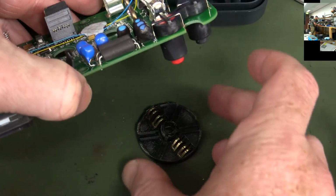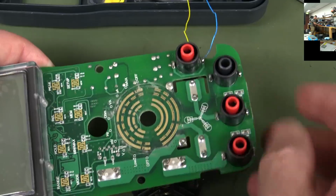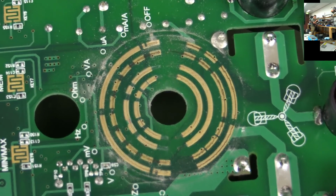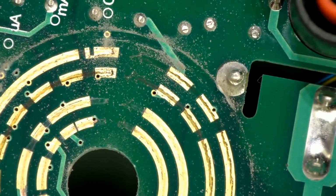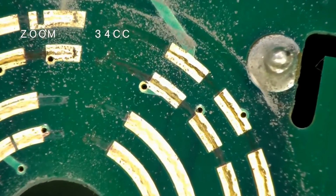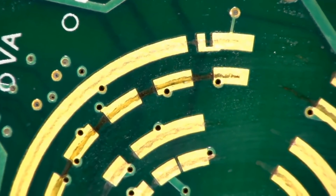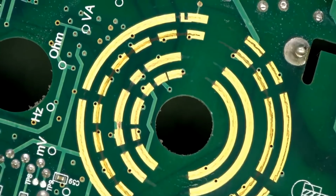Oh, there we go. No contacts came out this time. There we go. Oh, no, there's a bit of fiberglass around the outside. But apart from that, that looks okay. So that wear looks bad, but the contact resistance is still great. It's still like a couple of ohms. It's really quite nice. So that, put a bit of spit on that. So that's like, I can just wipe that. So it's actually, those contacts are pretty good after 10,000.